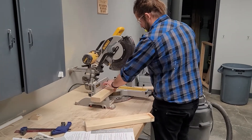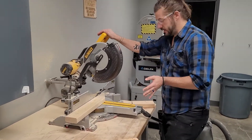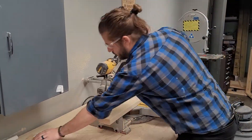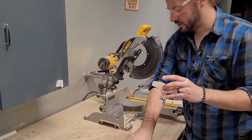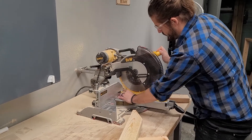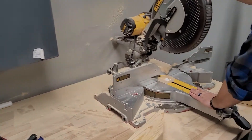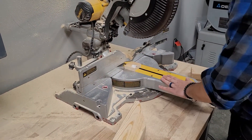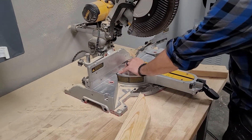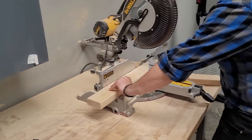I try to keep my hand about six inches away from the blade. Don't cut a small piece on it - that's the most absolute dangerous thing you could do. If you try to cut a little piece, there's a good chance you might lose a finger. Always keep your fingers outside of the danger areas, which are sometimes marked yellow, sometimes red. You want to stay at least six inches away.